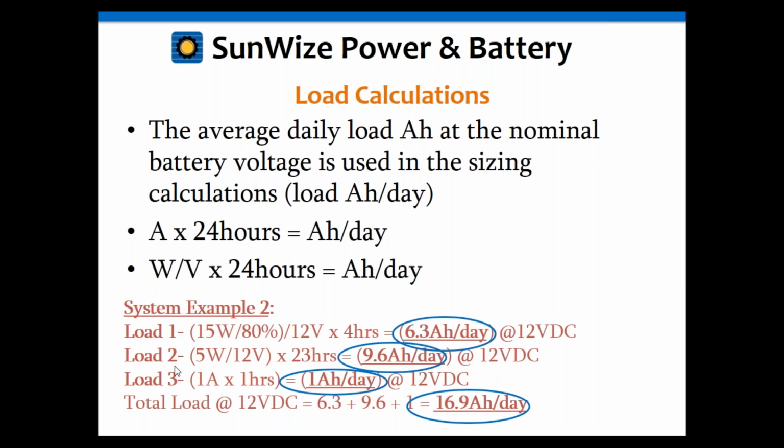Yeah, it was that slide that you just went to. In this case, we didn't use an inverter. We used a DC converter, but the same principle applies. And I would say most inverters have an efficiency of around 90%. Some of the bad ones might be as little as 87. Some of the better ones may be up in the low 90s, like 92, 93. But on average, they are right around 90.